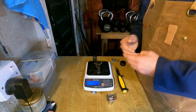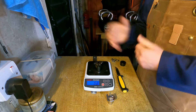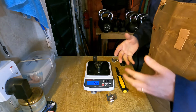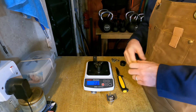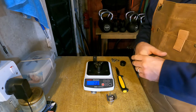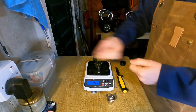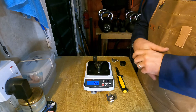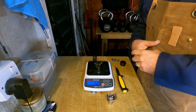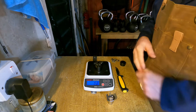On the BESS scale, just to give some frame of reference: 50 is the sharpness of a disposable razor blade — that's sort of the gold standard when talking about knife sharpening. Something in the region of 150 is sharp, quite sharp, probably sharper than an out-of-the-box edge but not as good as it can be. Buying a new knife you're probably going to get something in the region of 175 to 250. As a knife gets used and dragged across the cutting board, the BESS score increases — around 450 or so you start to notice cutting issues, and eventually into very dull knives you get into the high several hundreds, six or seven hundred, all the way up to a butter knife which is between 1700 and 2000 BESS units.